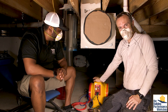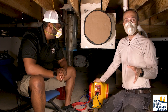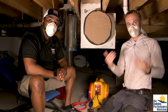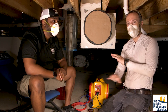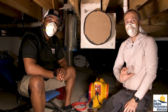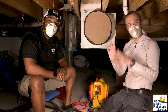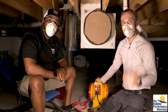This is the duct tightness tester and Rashawn is going to explain what we're about to do with this. You may be familiar with it for passing code tests — just saying "I passed the test." But it can also be used as a training tool. Pretend that I am your apprentice and I just built this, and you don't know what kind of work I do. So before you build the rest of the duct system and lump my work — which might be shoddy — in with the rest of the crew's work, which might be fantastic, and now everybody suffers because I did a bad job — let's test my work.